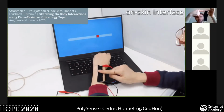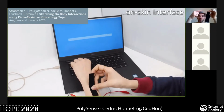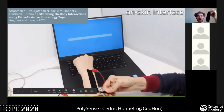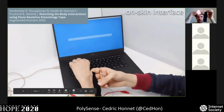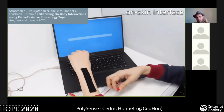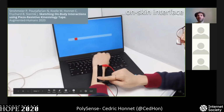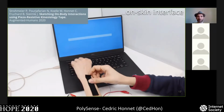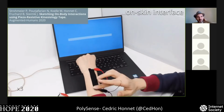It's a potentiometer. And so the hand comes, and by getting close to the red, you would get something that is close to the voltage input at the red crocodile clip. So this gives 5 volts. And on the other side, it's ground. So when you are close to the red, you have 5, and when you're close to the black, you have something like 0, or something between 5 and 0. And we can see the visualization that shows how to estimate the position according to this voltage. Super simple processing sketch. Again, it's available. Basically, how to make a human potentiometer. But we'll show some other application.